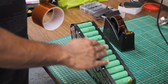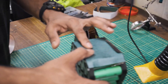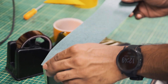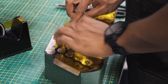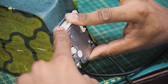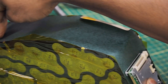Now I'm going to wrap the sides with Kapton and fish paper to add a protective layer. Then I'll place the BMS beside the negative terminal and run the leads that way. I'm going to glue the BMS down here on the pack — that's our battery negative terminal. Then I'll solder on the battery negative wire and run the balance leads.